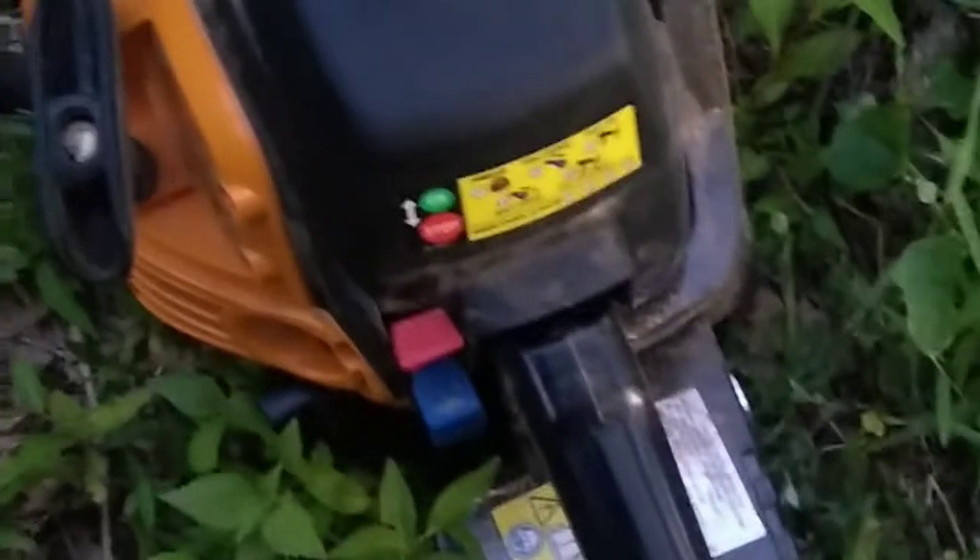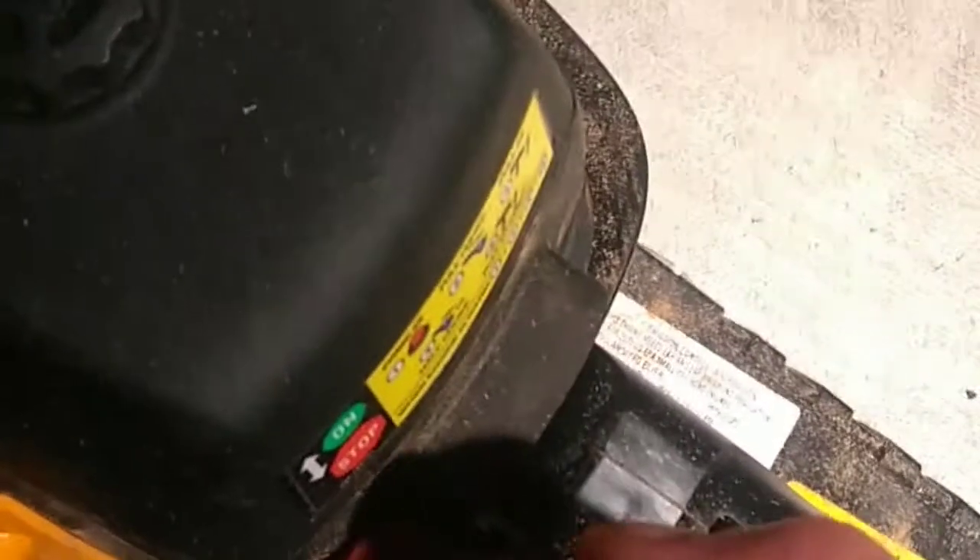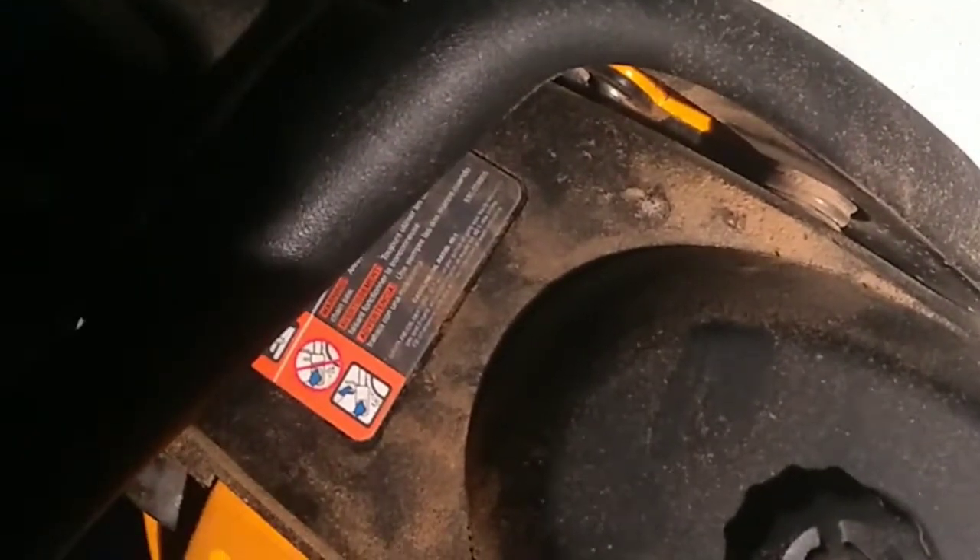This chainsaw has been sitting around for a couple of months, so it's cold. First thing we do: flip the switch to the on position and pull out the choke all the way, then give it a couple of pulls. Make sure your switch is in run instead of stop, choke all the way pulled out, foot firmly braced — hold that and pull the handle a couple of times on full choke, then go to half choke for a couple of pulls, then all the way in to run. You've got to be ready to take off. Make sure your chain brake is off.